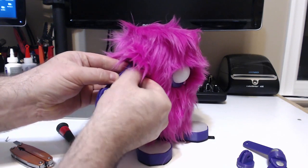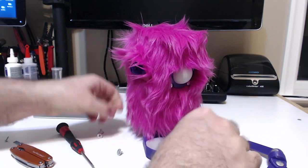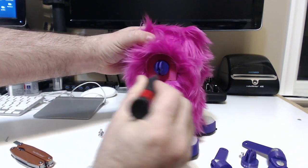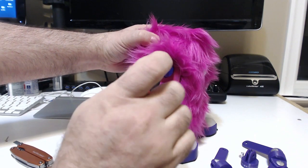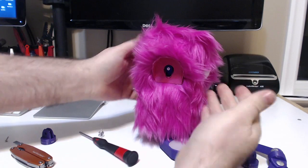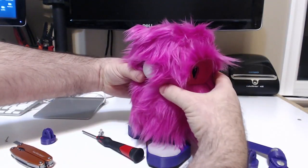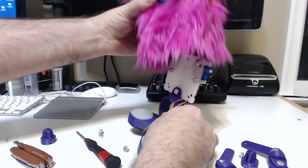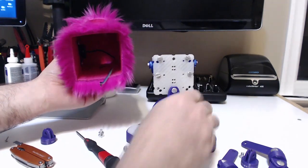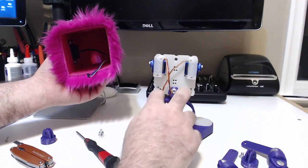Let's finish up this other side. Once we get the connector off here, there's just a screw inside. Remove the mounting plate — those two pieces actually hold the body on to the torso. To get the body off, grab the box and just squeeze gently, which should get you past the servos. And there's the torso — mounting plate plus the servos on the back, cables go through the bottom.